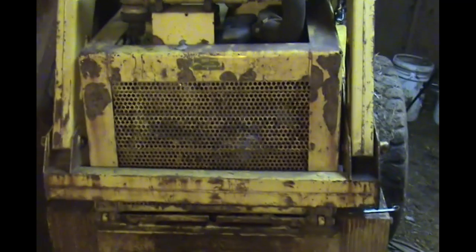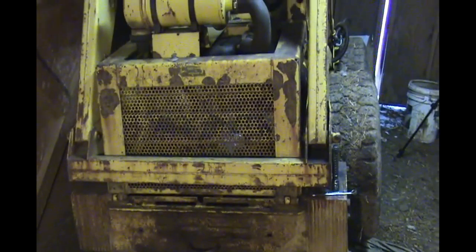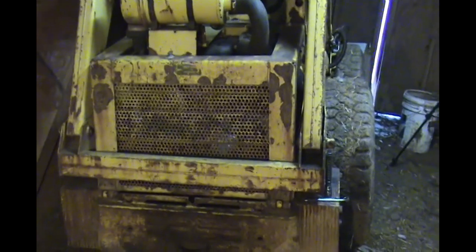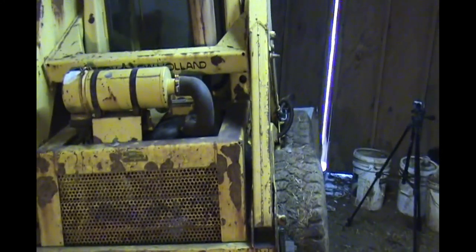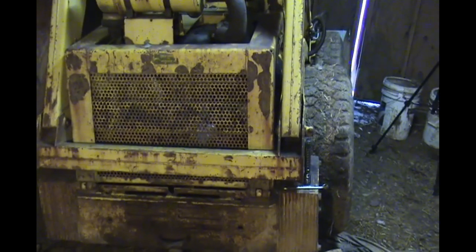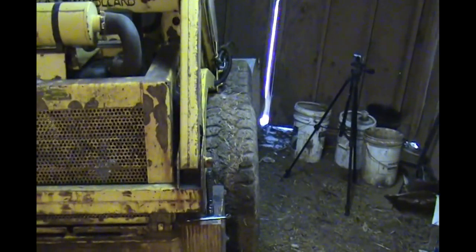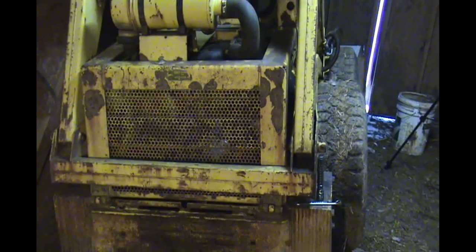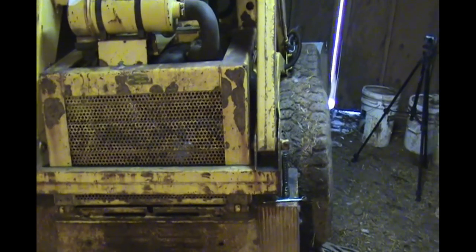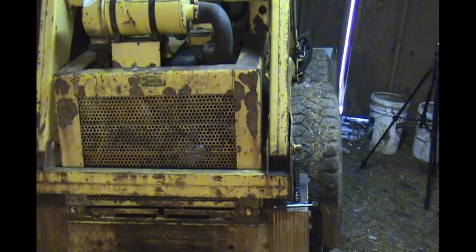And the problem with this skid steer is that it's really good access when you can open the back, but you can't open the back unless you put the boom up in the air, and you can't put the boom up in the air unless it's running, other than with some lifting techniques with an excavator to manually put the boom up in the air. I don't like doing it, it's not fun. The other thing you can do is take off that back piece without lifting up the boom, but it's like a 3-hour project. It's just a few bolts, but just maneuvering it out of there and the stuff that has to come off to get that off is ridiculous, where if the boom's in the air, it just opens up and hinges down.